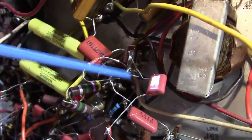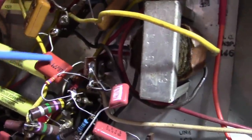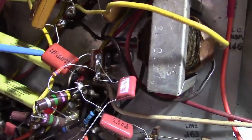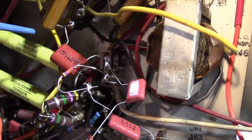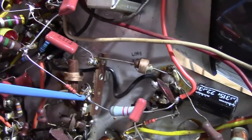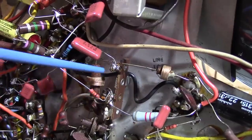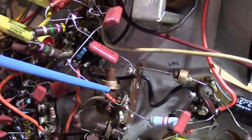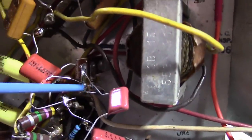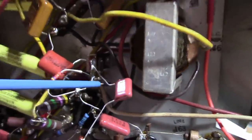And on that terminal strip, that's where the diode got installed, and the 1/2 microfarad cap. Rather than using an electrolytic, I used a plastic film cap. Why not? They're small enough. So that's what that guy is. And here's where we're picking off the signal from the sync pulse. It's after the second peaking coil, 10K resistor, 0.1 microfarad cap, and that feeds into the anode on that diode, which I did have handy.